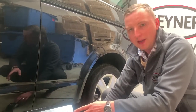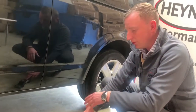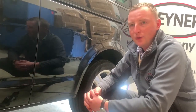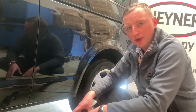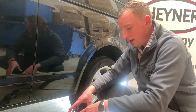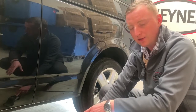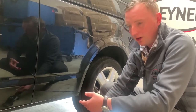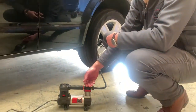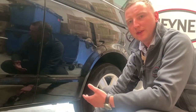It's basically made to reach high pressure. It's not to be used for a longer time. So if you have a swimming pool for kids and you want to use this compressor to pump it up, it's not a good compressor for it. Small pool toys, yeah, good enough. That's because it's made to work up to 7 minutes without a break. Otherwise this one will get red hot, and it's not for the volume of the air.